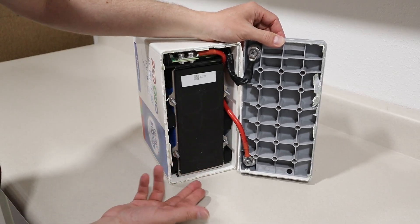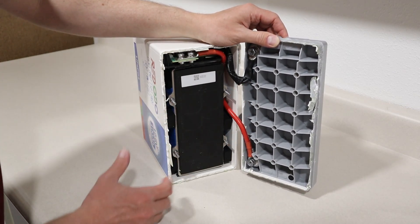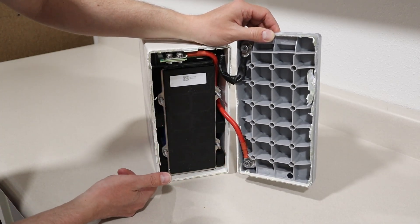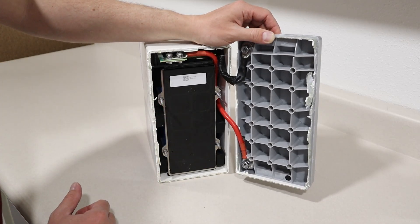You have some really good conductors here — it looks like four AWG cables, or possibly two eights in parallel. There's the battery. It looks like it has foam spacers, and there's way less airspace and wasted space in this battery versus the other 100 amp hour batteries I've tested.